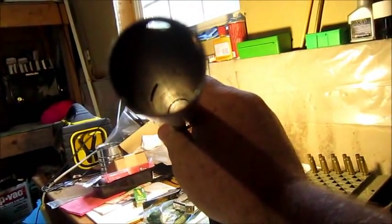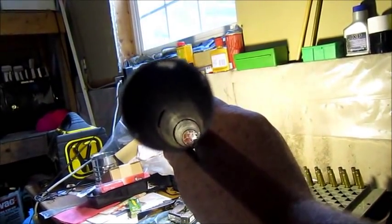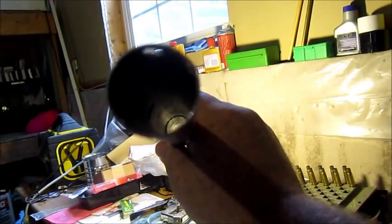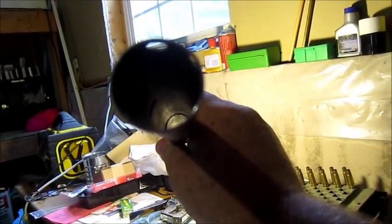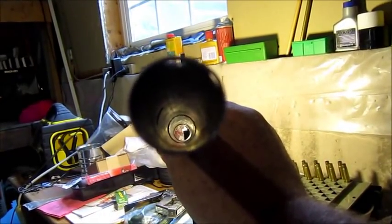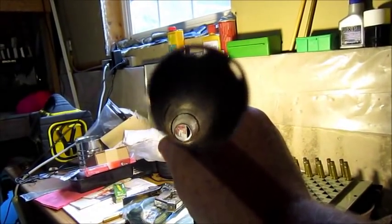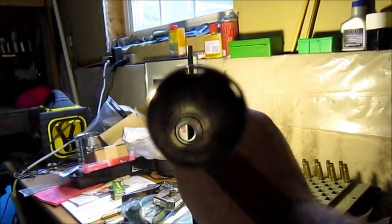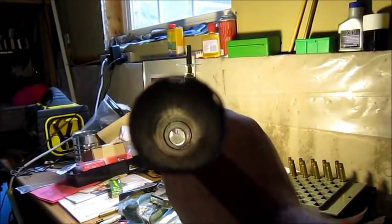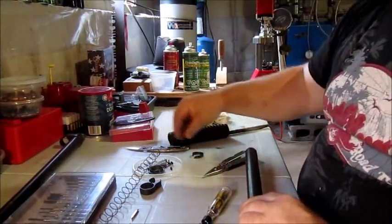I don't know how well the video is showing it, but you can see a dark line in the middle of the tube, and that's actually a gap where the weld and the coupler holding the two pieces together is. And unfortunately, that sort of acts as a catcher or a venturi or whatever, a closing point, so that the follower can't feed another round, causing this thing lots of trouble. Alright, reconstruction.